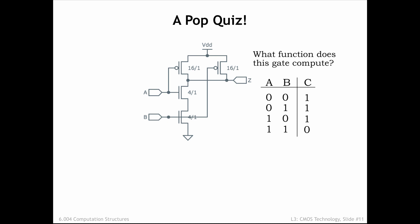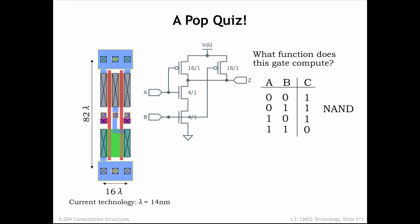This particular device is called a NAND gate, short for NOT-AND, a function that is the inverse of the AND function. Returning to a physical view for a moment, the figure on the left is a bird's-eye view looking down on the surface of the integrated circuit, showing how the MOSFETs are laid out in two dimensions. The blue material represents metal wires, with large top and bottom metal runs connecting to VDD and ground. The red material forms the polysilicon gate nodes, the green material the N-type source and drain diffusions for the NFETs, and the tan material the P-type source and drain diffusions for the PFETs.